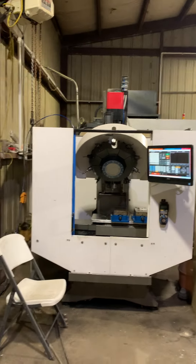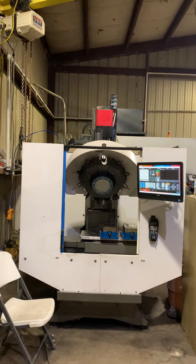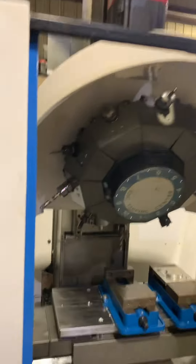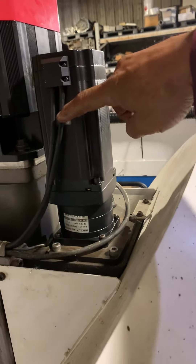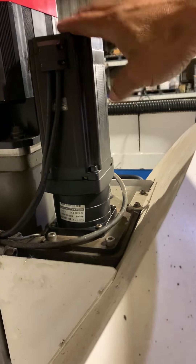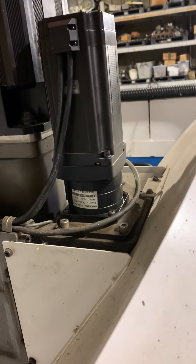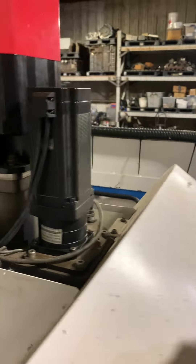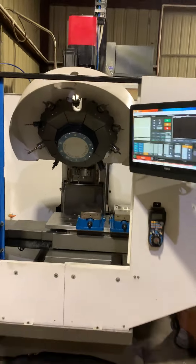The other upgrade — something I regret and I'm trying to fix now — is the gearbox for the carousel motor. The carousel was running at a one-to-one ratio, and I went ahead and bought a gearbox with a five-to-one gear ratio. You could probably get away with three-to-one, but I got the five-to-one — same price pretty much. I was able to get the machine going faster on the carousel tool change.